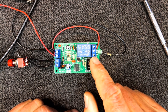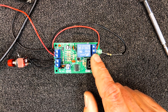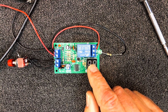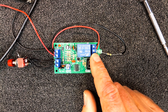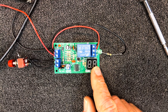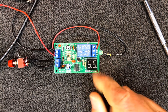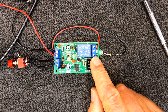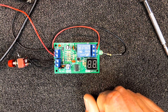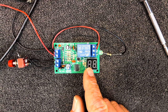We've got two sets of contacts on that: normally open and normally closed. Normally closed is the same as always on — when the timer is running it'll go off, so we can have a light that's on and then trigger the timer to turn it off for so many seconds. The normally open contact is normally off, so it stays unlit until I trigger the timer, and then it'll light up for the set time and go out again.